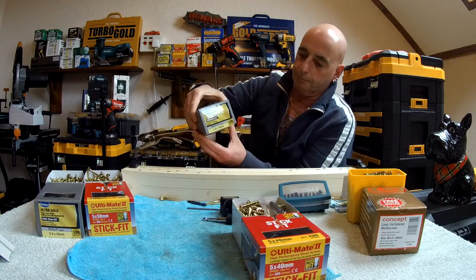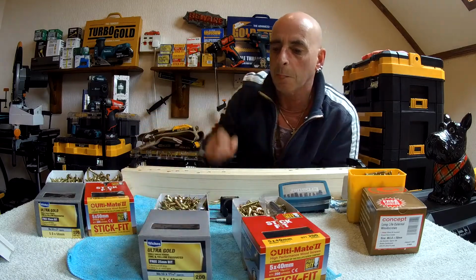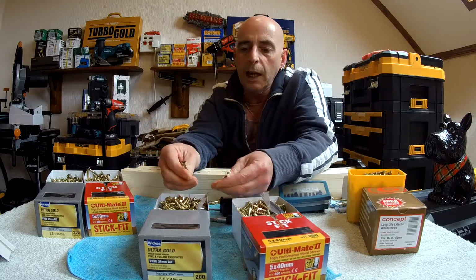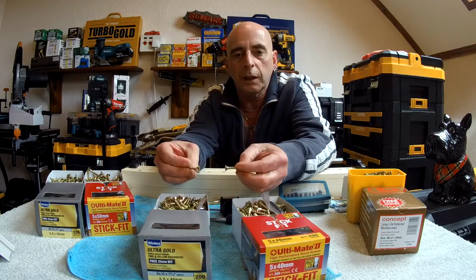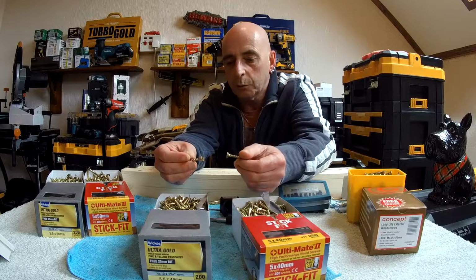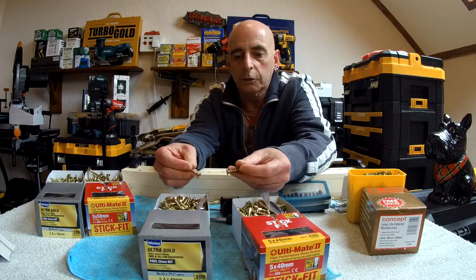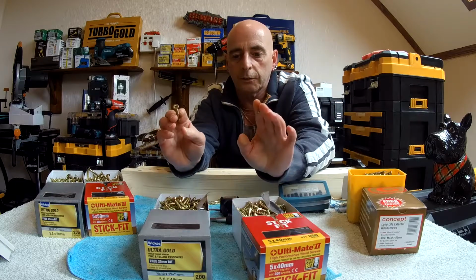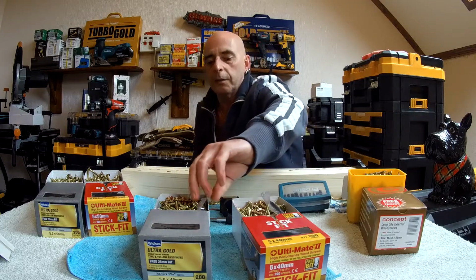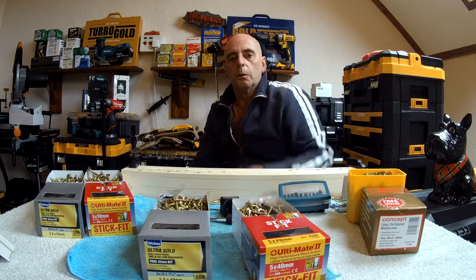Right. Have these been opened? Yes, they have. Thought that was weird. Right. I'll put that there. The problem is, this one and this screw here are so identically the same, they have no countersink underneath them. They have no ribs underneath the head, which means when they go into the wood, they're going to start splitting it up whether you like it or not. So really and truly, a little bit of a fail in the same company as well. They are absolutely identical, but the fact is the boxes are different. You get a 25mm bit there and you get a 50mm bit with that one there.